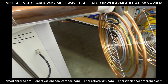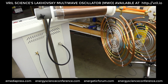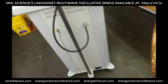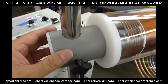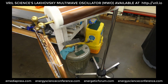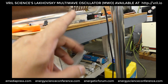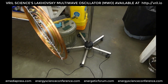It cost about $25,000 by the time Bruce got it to Seattle — that's for the unit plus shipping. These are the transmitter coils — primary, secondary. He's got the rings, and these ones are strong. It's adjustable, can slide up and down the bar. This one basically stays stationary, and this is the one you can roll back and forth — so this would be the receiver one. He has the windings to balance the copper mass with the transmitter. It taps directly to the secondary resonator coil, which also slides up and down on the stand.